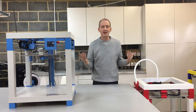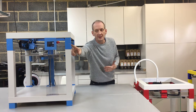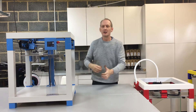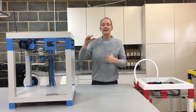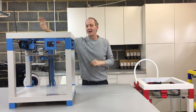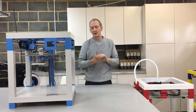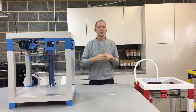Some other features which have now been added are the tension springs. Before, you just tightened the belt as tight as you could and clamped it. Now you can see two screws — one there and one on the opposite side — so we can actually tension both the Y belt and the X axis belt. There's a little M3 hex screw just to set the tension up on that.